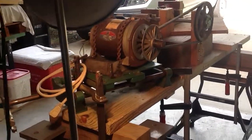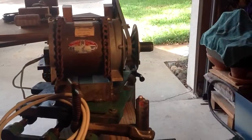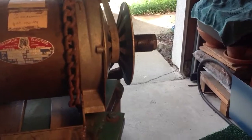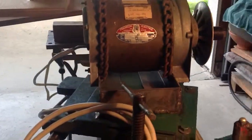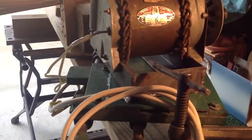It's got a three-quarter horsepower, 3450 RPM motor with a variable pitch pulley on it. This motor had some kind of weird base configuration — it was actually round. It mounted from these bizarre earlets, the lower earlets, one of them being in the bottom right of your screen, and the other one over there on the left, and they're angled to each other by some strange center distance.